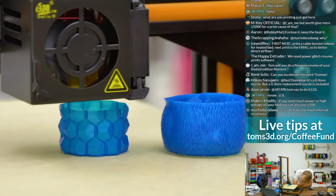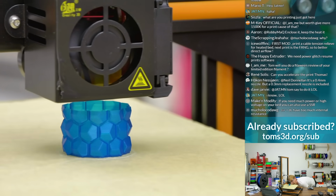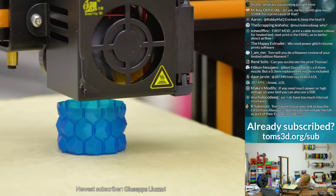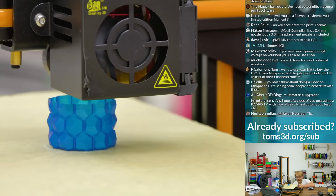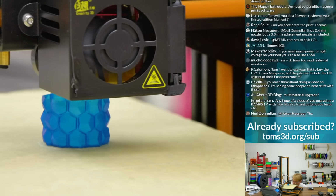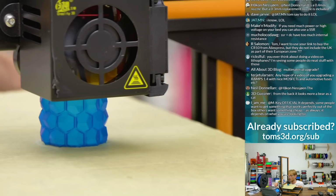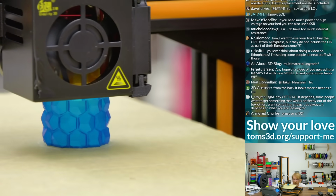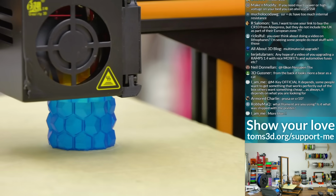I have switched to a hex vase, and I've got to say, first of all, I like the filament, but I feel like we are tweaking it to make it even better, even more likable. But also, it prints pretty nicely. It prints really well. There is a good bit of ringing going on. It might just be that the belts, of course, are somewhat cheap. Yeah, but the Y-axis belt could use a bit more attention. But this is looking pretty nice.